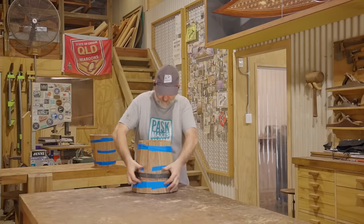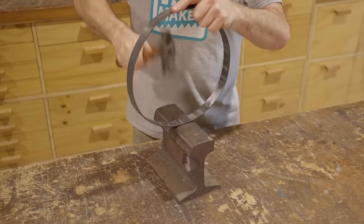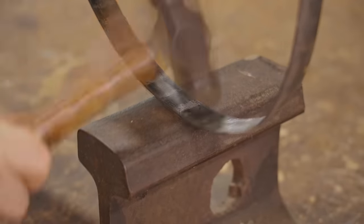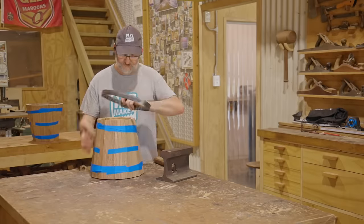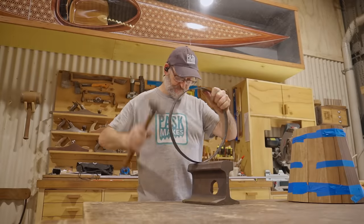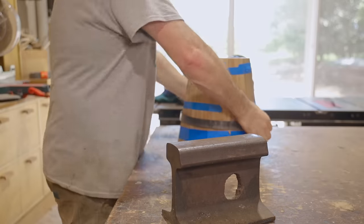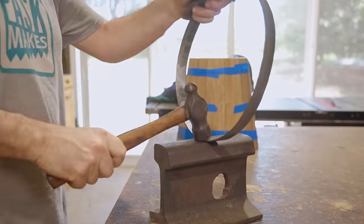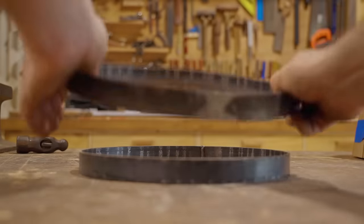The straight sides of the ring don't match the sides of the bucket so I need to shape the ring to match. It's very easy to do — you just need to hammer along one edge, which will stretch that one side of the ring. After making a full pass I'll check how it's looking — that's looking good but it still needs some more. It may look like a lot of work but it really isn't — it only takes about a minute to go all the way around once. I'll put it on top of an untapered ring just so you can see how it's stretched.